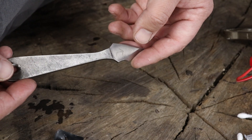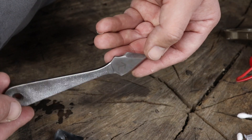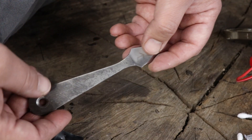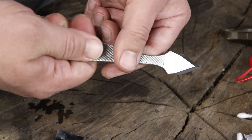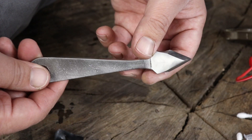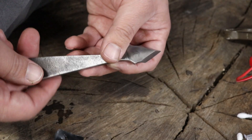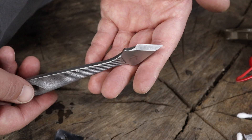I think you can do it at home, but it needs a little bit more voltage and a little bit more amps. Now if you're wondering what this is — a friend of mine sent me a picture of a marking knife used for woodworking. He said it's basically chisel sharp, comes to a very sharp point, used basically instead of a pencil to mark your board. I did this out of an old file, so it has a little bit of texture up here so you can grip it where the file used to be — it was a very dull file. I drilled a hole back here, and most of this was grinding work. I filed the bevels in and filed these little notches in. It was just a fun little project, but it wasn't worth filming — it's basically just me standing at a grinder. But I did want to try the etching and try to get my mark in there.